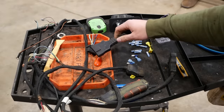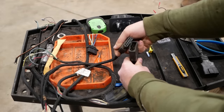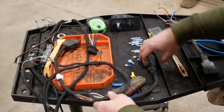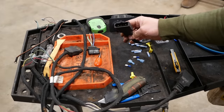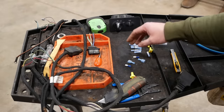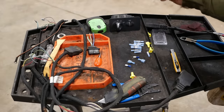The male side of the connector is fine, so we could use that. I have another harness here off of another plow - it's a similar shape, but this connector is not the same at all, and it actually doesn't have enough wires. There are only seven wires in this connector and we've got nine wires that we need to splice together. So we have to get a new connector. Western sells a repair kit, or there are some aftermarket ones available too. But unfortunately today is New Year's Eve, it's about 11 o'clock, and the Western Snowplow dealership is closed. So we couldn't get parts before this big storm comes through.